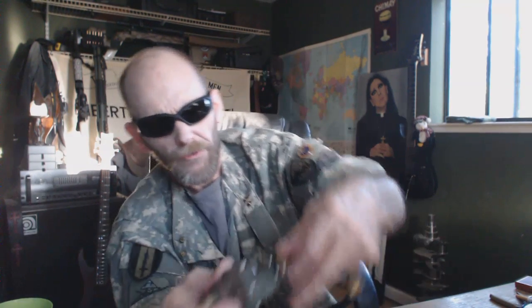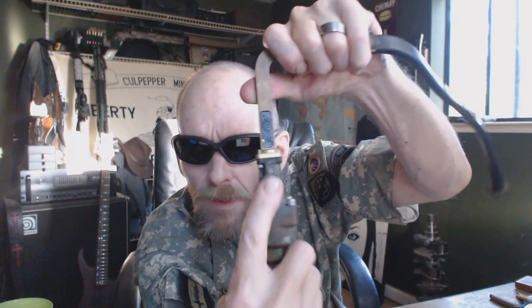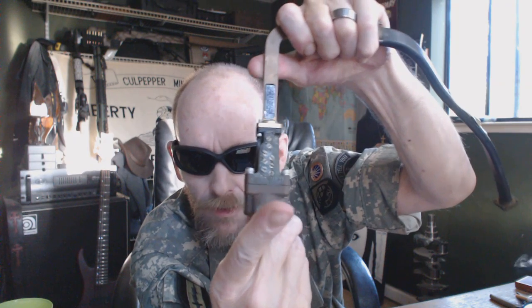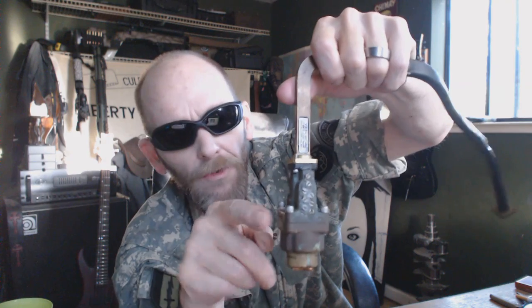This connector also has what we call slugs. These are basically just screws with a small tit on the end of them. It's a cavity, so they go into the cavity and you tune them in and out with the sweep gear, just like when you're dent-tuning one of these rigid sections.